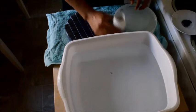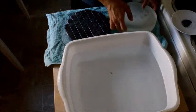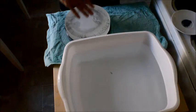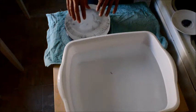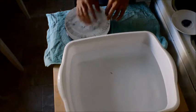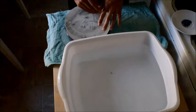So you would put the silicon carbide onto the tool, like so. It doesn't really matter how much. And then you would take the glass and just set it on top. It was described to me, in terms of the technique, as consistent randomness. So basically what you would do is arbitrarily decide how many strokes back and forth you would like. For me, I picked 10. And so that would be the consistency.